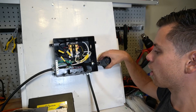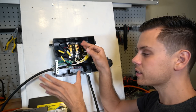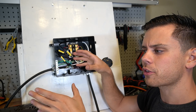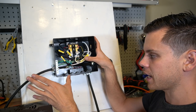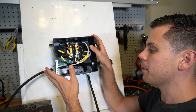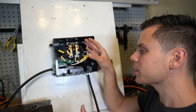Regarding grounding: if you have an RV plug with a true earth ground, the ground bus bar will ground everything connected to it. If you have this in an off-grid stationary system like a cabin or shed, run a wire from the bus bar down to a grounding rod — though it depends on your local codes. Understand that a vehicle chassis is not a true earth ground where you can dissipate excess charge. For added protection with all AC circuits, it is ideal to ground to the chassis. For a marine battery, grounding requirements are totally different and must be perfect.